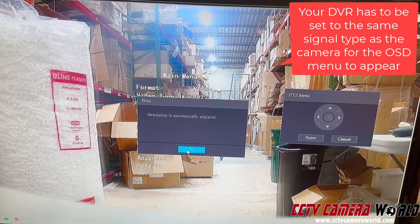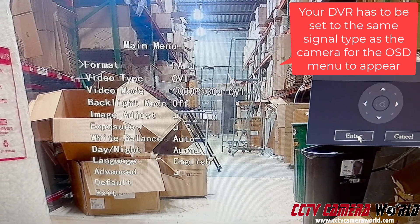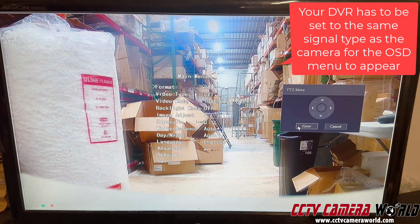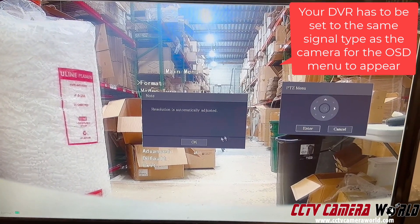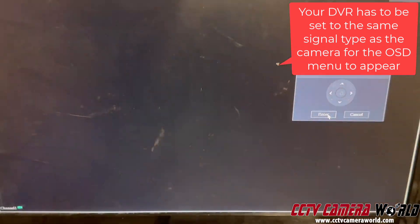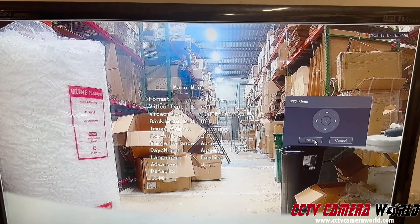So now this is actually 1080p video. Also when you're in this menu, make sure your format is set to NTSC. If it's PAL, let me show you what happens — sometimes depending on your DVR, you may get video that's all sorts of messed up. It's because there are different video standards that are not talking properly to each other. To fix that, go back in there, switch it back to NTSC, hit Enter, and that should be it. After a few seconds the camera adjusts and the picture gets better.